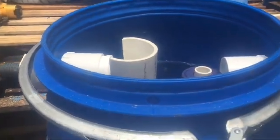Hopefully this thing is going to be collecting a bunch of dirt and sediment. This thing is 15 gallons, so it's going to hold 15 gallons at 8 pounds — about 100 pounds. I'll put a valve on the bottom end here in this lid so that when you get ready to clean it out, all you'll have to do is open it and it'll all come out. Right here we have the valve on the bottom of the lid. If it happens to get full of dirt and mud, you can open the valve up from the bottom, poke a welding rod up in there, and you can get all the water out. The only thing you're going to have to deal with is just dirt and mud, instead of having your hands underneath there with 100 pounds of water coming down on you.